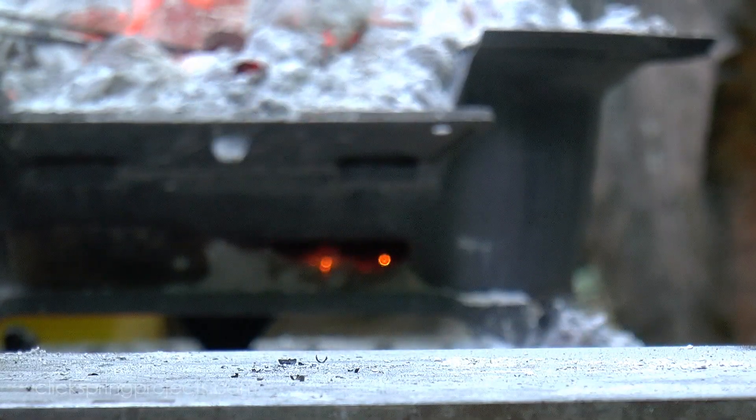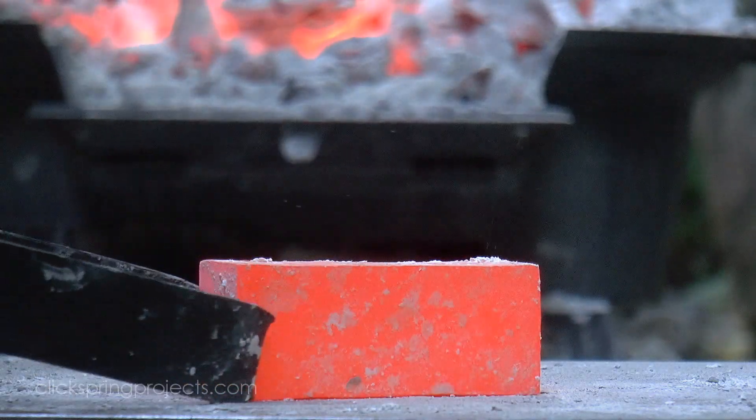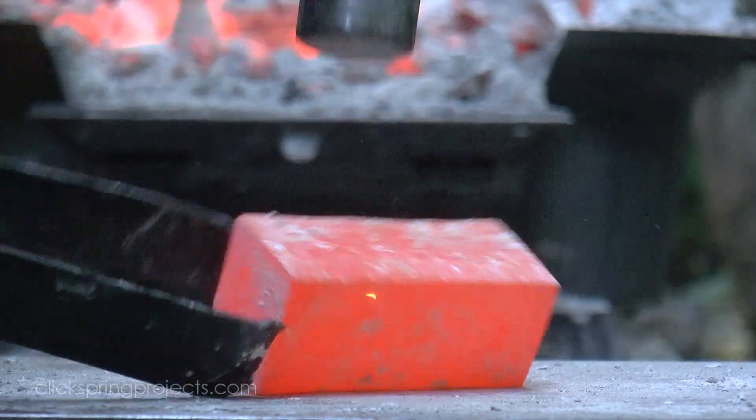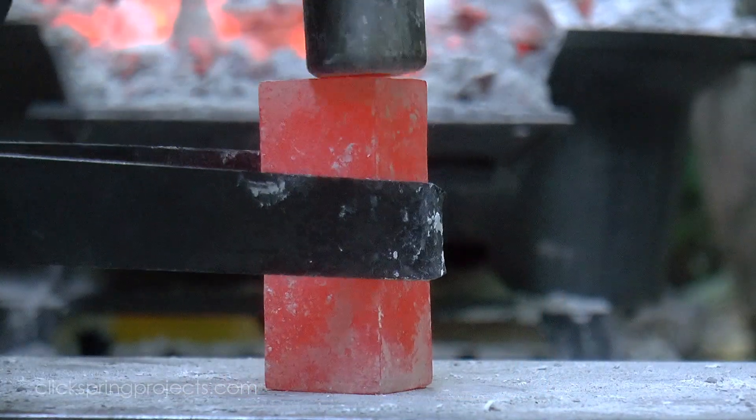The blocks are larger, and so act as a broader heat source to raise the temperature of the general work area. They can also be left cold and so act as a heat sink, to protect a part that's already been soldered into position.